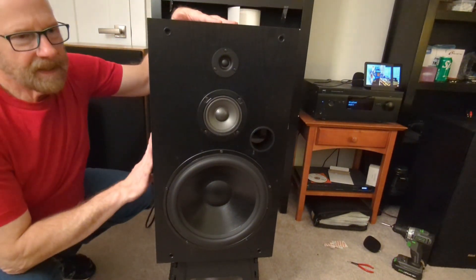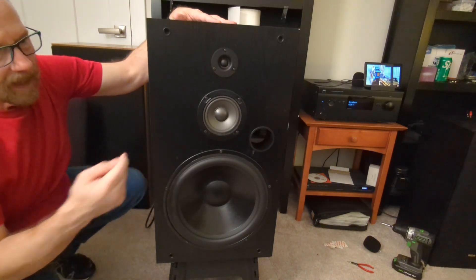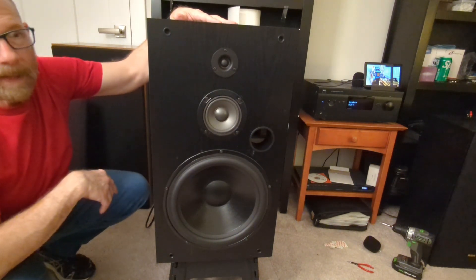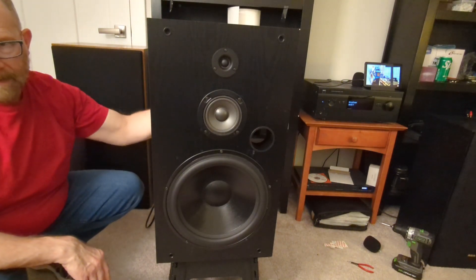As far as the front goes and the sides and top, definitely not so much. I'm not sure about inside the port. What you're listening to is the exciter mounted to the back panel — the most vulnerable panel — on the inside, turned up to negative 10 dB, and this is what we're hearing out of this cabinet right now. The majority of that is coming from the back. It's about as loud as I really want to go with it.